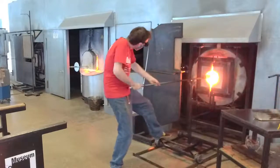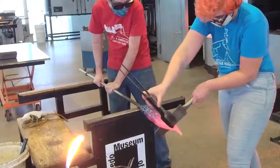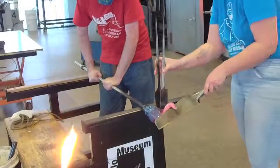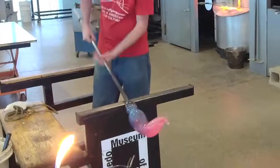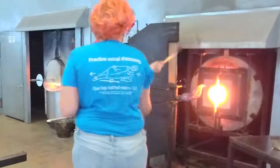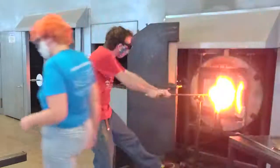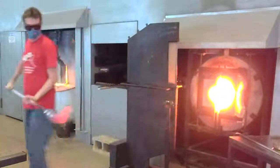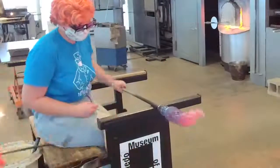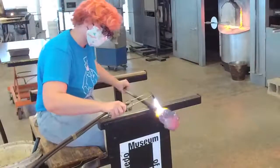Sandy is doing a bit of feathering, boosting a little extra heat into the body of material. Kelly is folding it over — a really cool move. Those creases acted as a way for the glass to naturally fold over itself. We're almost done with the piece — the majority of the shaping is completed. Now we need to flatten out the base, connected to the pipe, by boosting a little heat into the back one more time with the hot torch, pushing the glass back up on itself and creating a nice flat spot to break the piece off the pipe.